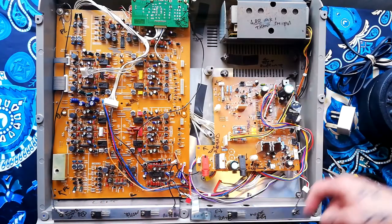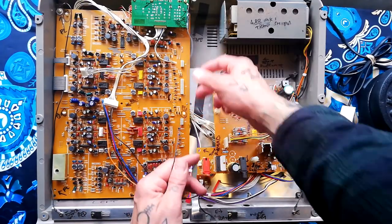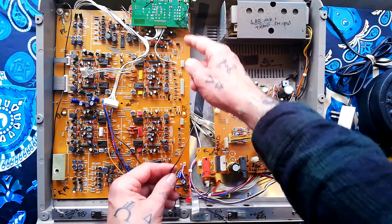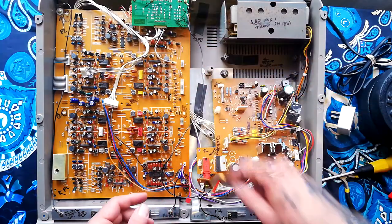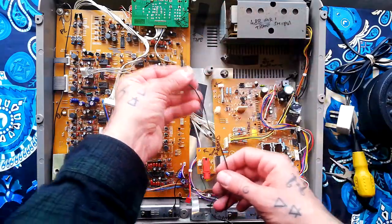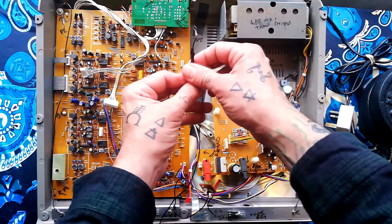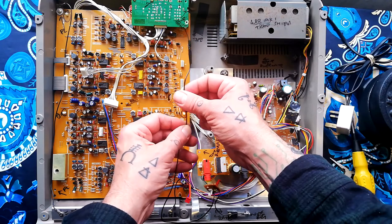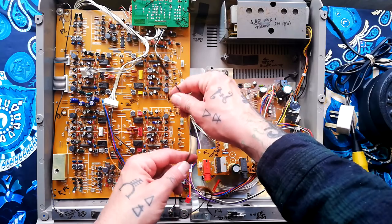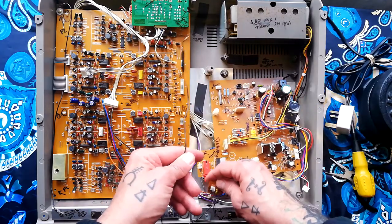When I got this, there was one wire loose — it looked to me like it was joining earth to another part of the system. I've actually made a bit of a guess about where it goes. So if when you open yours there's a long cable going from this tiny daughter board somewhere, trust where it's placed in your unit, because I have yet to establish that mine is correct. If I hear a buzz, I'll start connecting it to different places and see if I can get rid of any background hum.